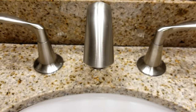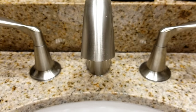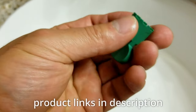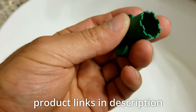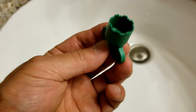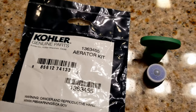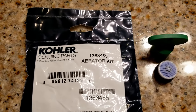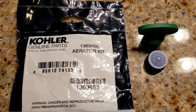There's also another type of aerator that's a little bit more difficult to get to — this one is hidden under the faucet. For that you're gonna need a key like this. If you check out the description I have a link, but you're gonna need that key. These grooves are gonna get into the aerator where you see the little grooves and we're gonna use this tool to remove it. In the description I do have a link to the Kohler kit I'm using here, which comes with an aerator and a tool to remove it.